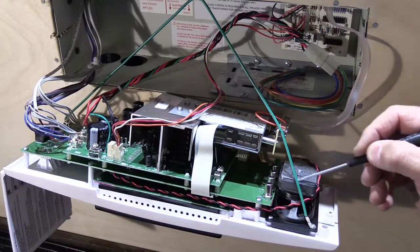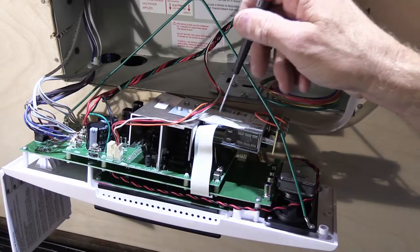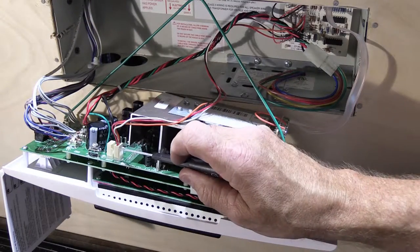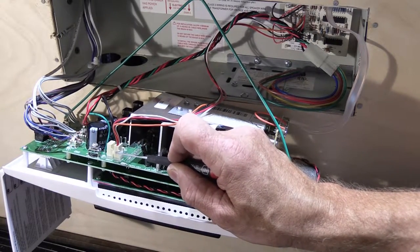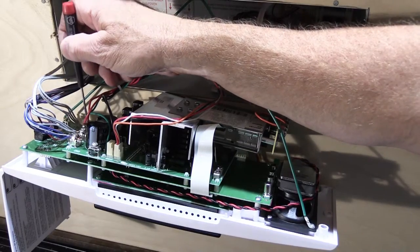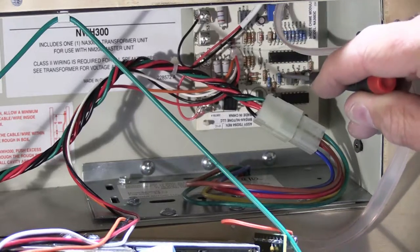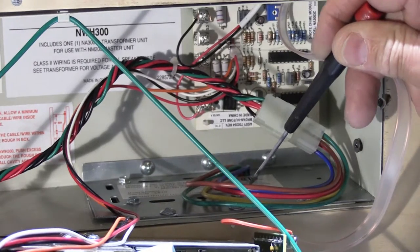Let's do a brief overview of the back of the DMC 3-4. On the right-hand edge is the magnet on the back of the built-in speaker. On the very back is the AM-FM tuner module with an antenna adapter board on its end. Over on the left are some electronic components, and there are multicolored wires — black, white, orange, and red — connected to a socket. These come from the built-in chime module. Down at one end are the terminal board connections for the wires from all remote stations. Inside the wall housing is the chime module circuit board, and at the bottom is the low voltage transformer.